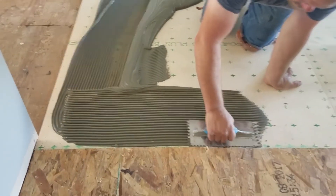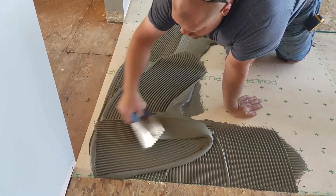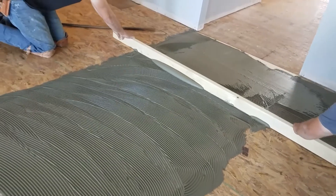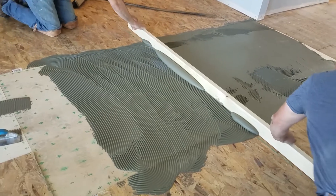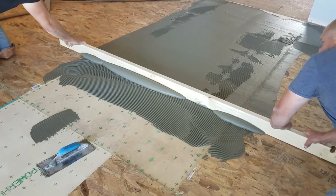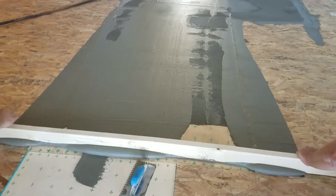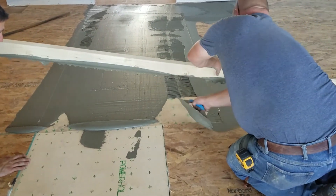On this situation I had a big hump where a joist ran — we built the floor up on both sides and now we're going to screed to make it flat all the way across. I'm using a good quality thinset because it has a little flexibility and bonds to wood nicely. You can see how I'm running this 2x4 across as a screed, pulling out the high areas and getting it nice and flat. Once done, we let it dry and come back to fill over the top again to make it perfectly flat. This is definitely my preferred method for both small and large dips.